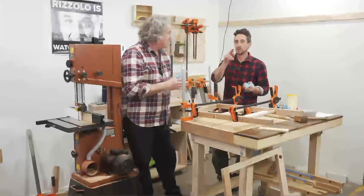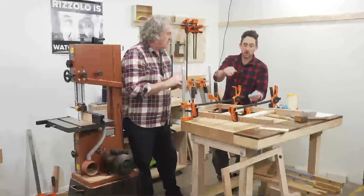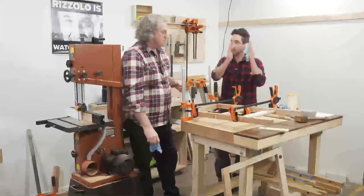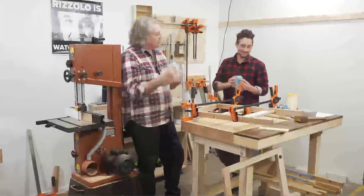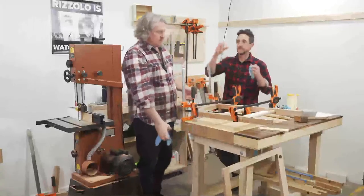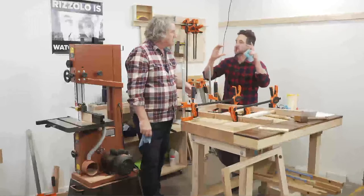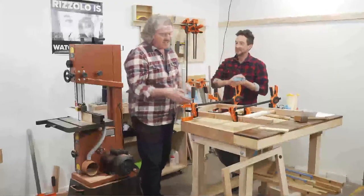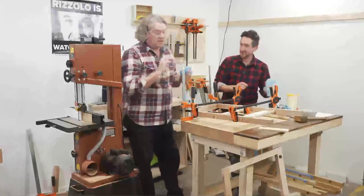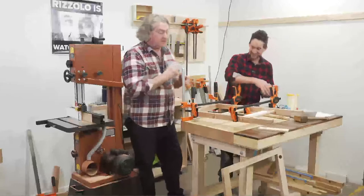And tell me if it matters which direction the wedges enter the tenon. I know that it matters which direction, so they're not going to split the timber over the mortise. I don't think it matters because... how can it split it? Because it's encased. Timber expands a different amount along its growth rings as opposed to... Yeah, I understand this, but even still... Anyway, if anyone's got an idea... It's a chairmaker's question. Any chairmakers out there? Hopefully.